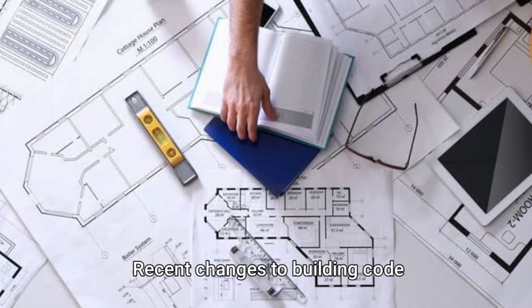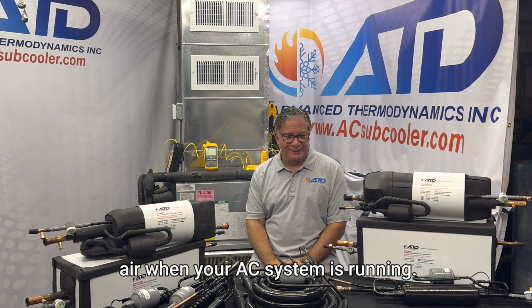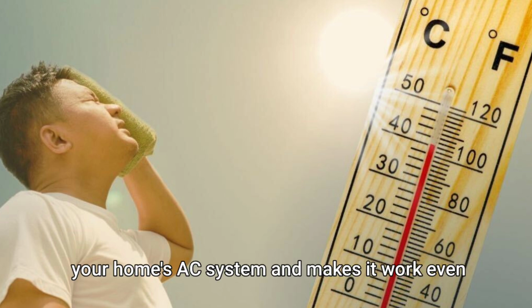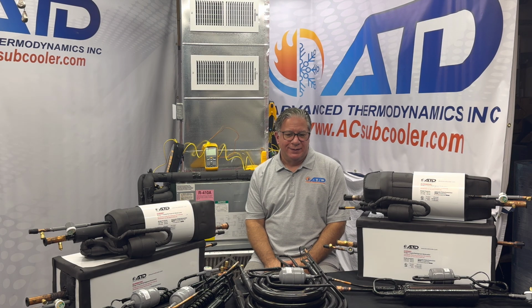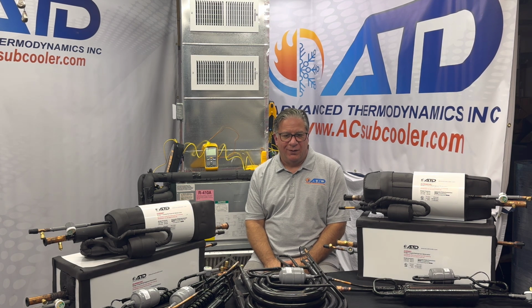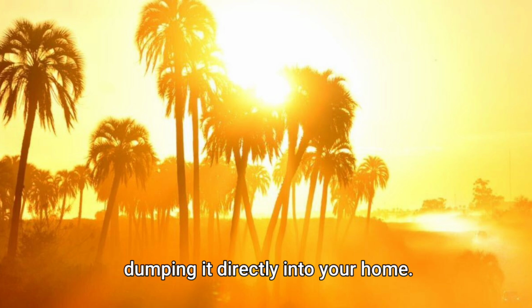Recent changes to building codes require new homes to bring in a certain percentage of outside air when your AC system is running. This can introduce extra heat and humidity to your home's AC system and makes it work even harder to try to remove it. Some systems even have timers set up that will run the blower without the AC on every few hours, all while drawing in hot, humid outside air, dumping it directly into your home.